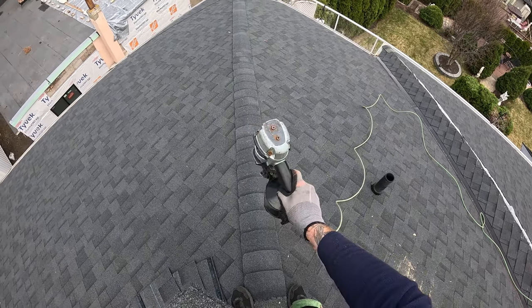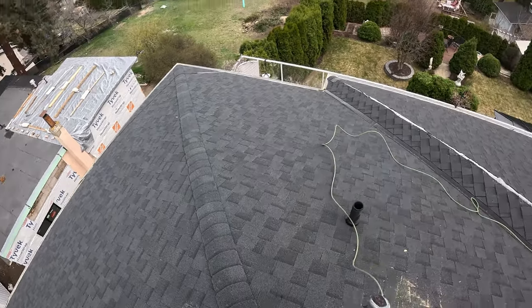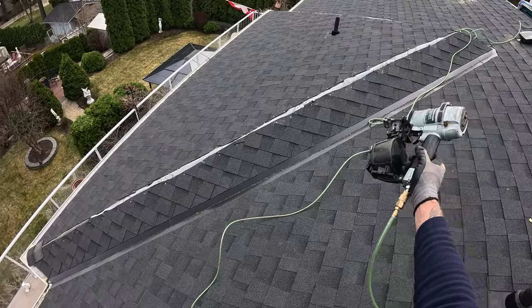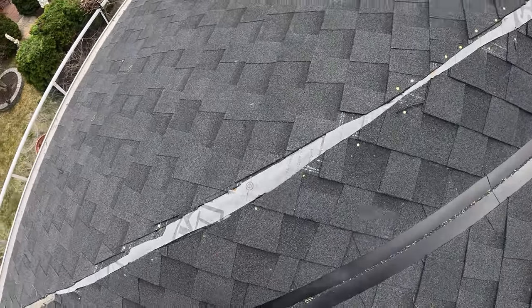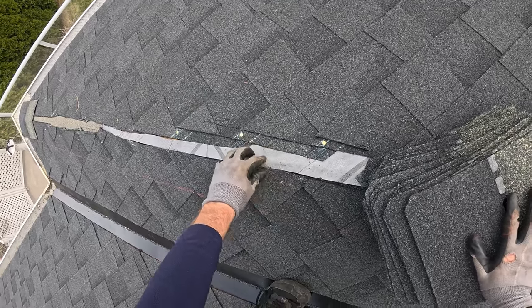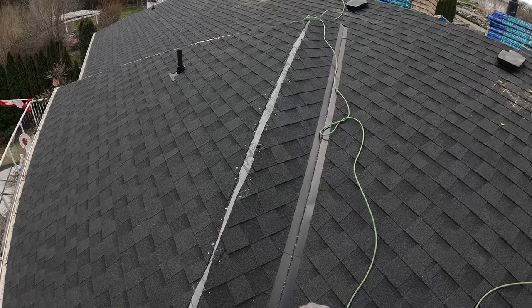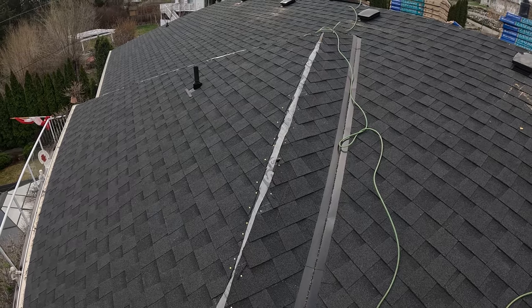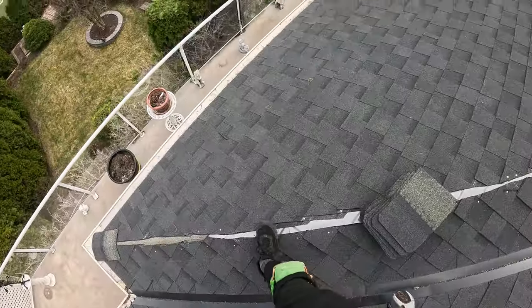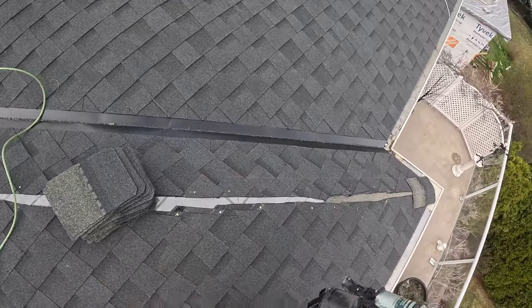The hip profile changes where they have the hip cut over on the other side, so you can see it in the top of the cap. You can't see it from the ground, but I guess you could run a saw along the plywood after ripping and trim the overlap down. But I'm not gonna start framing for free. Here it's really predominant, so that'll shift the cap either left or right depending on which side it overruns. It's annoying, but is it gonna do anything? No. It's more for uniformity than anything else. It has nothing to do with the function of the cap, unless it pulls it way, way over.